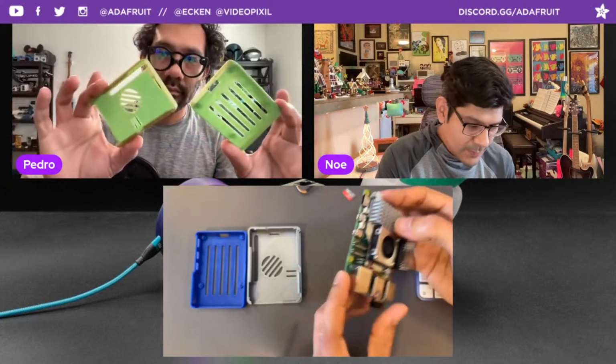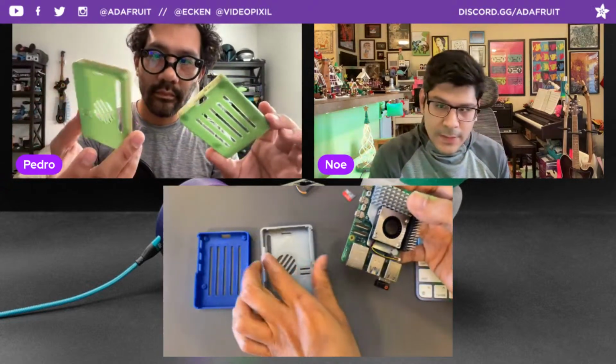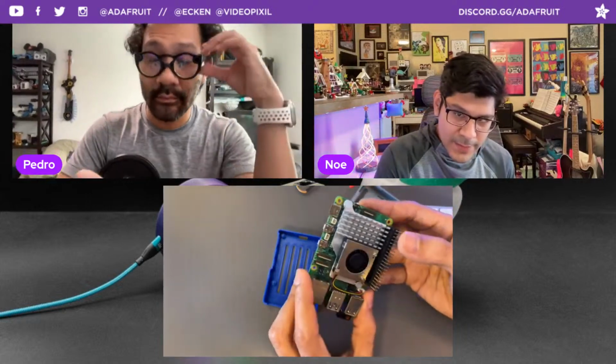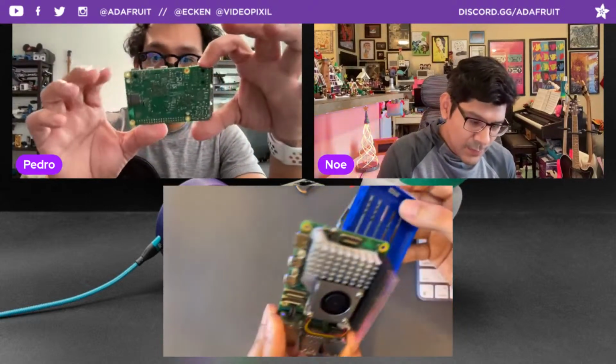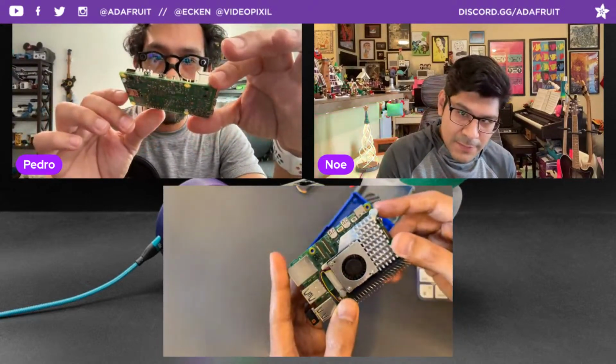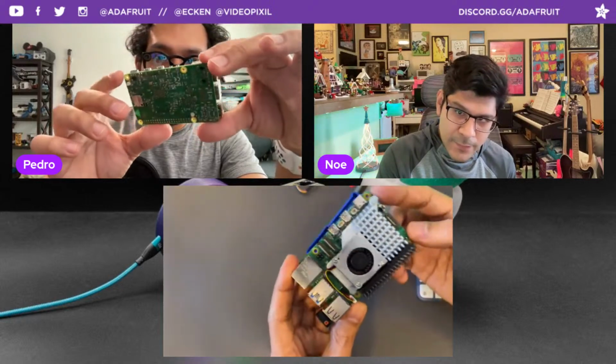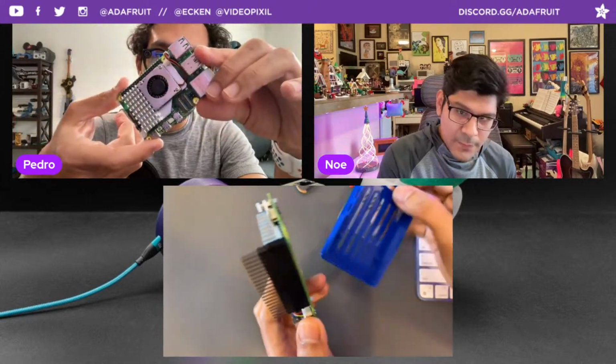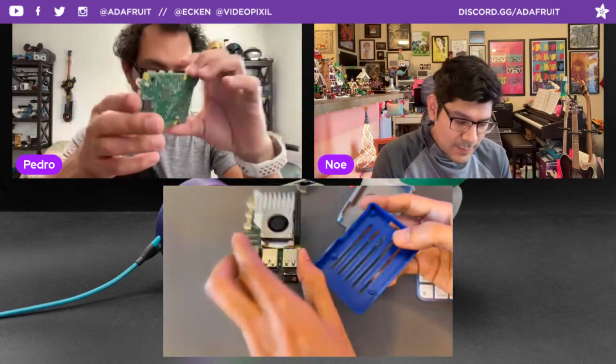And we'll talk about some features here. So I wanted it to, of course, accommodate the active cooling fan, but also not really use any screws. So you have the same mounting holes, the 4 mounting holes that are M2.5 sized. So I just wanted to make some built-in standoffs.